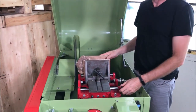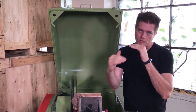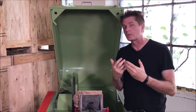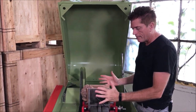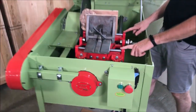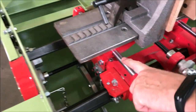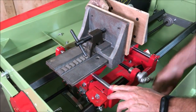Movement in a carriage means blade marks. It means more grinding to get the slab smooth, to get the scratches out so you can actually create pendants or earrings or other types of things. Movement is also really important. So you'll notice on this carriage here, if you'll bring the camera, we have 2 crossfeed rails. So when I crossfeed this carriage, it's riding on 2 rails.